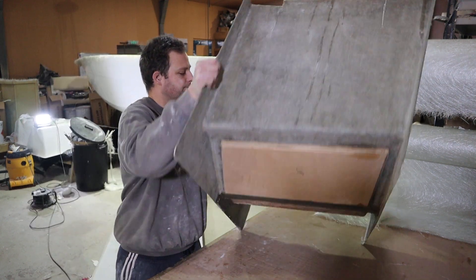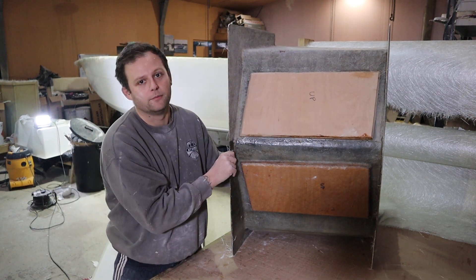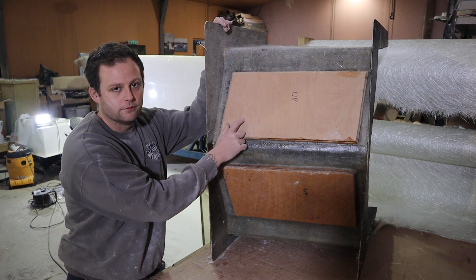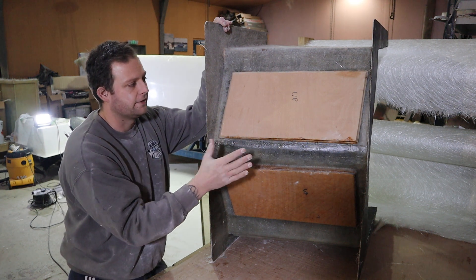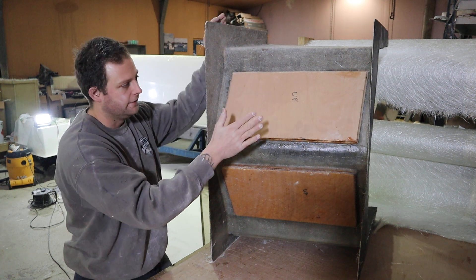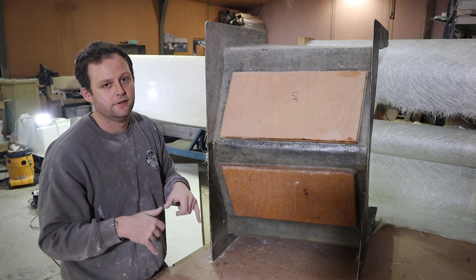After that stage, we've made up some wooden panels out of 18mm marine ply and then bonded these onto the mould using cabosil — microfibres, silica, whatever term you want to use. Then sandwiched it with timber on this side and some very heavy weights on the other side to try and push back and straighten those faces.